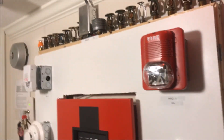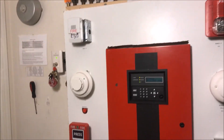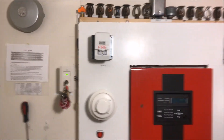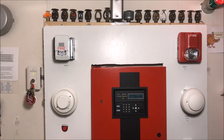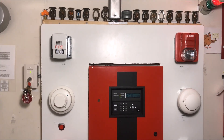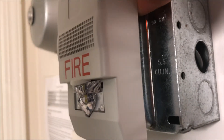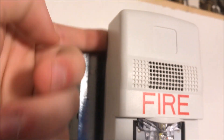This is running strobe only because it is a four-wire device. Everything is completely dark around me because we're going to be doing strobe comparison. I like LED strobes better than xenon tube strobes — there are definitely some similarities, differences, pluses, and minuses. The EST Genesis GL Series LED has a multi-candela selector switch in the back and a slider switch for low, high, coded and low, high, continuous.